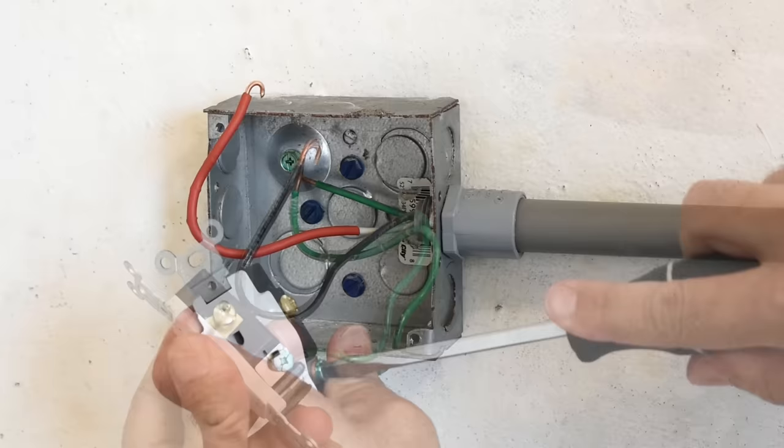I'm going to grab this with needle-nose pliers. You can see the heat shrink has been applied to this white wire — now identified as hot. I'm going to pull it up and connect it to the screw on the second pole. The neutral wire is now identified as hot, connected to one pole, and we have the original black wire on the other pole. The ground is connected to the neutral bar. Let's turn it on and check the power. Measuring between one leg and ground: 120 volts. And between both legs: 240 volts. There you have it.